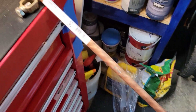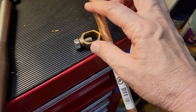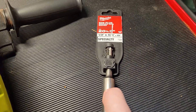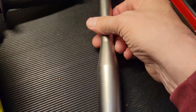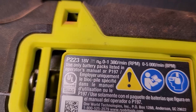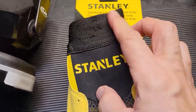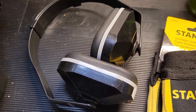For this project we're going to be using an eight-foot long, five-eighths of an inch thick ground rod, UL approved. We're also going to be using a five-eighths inch grounding clamp that will attach to the rod and hold our cable. We're going to try to drive this in with a Milwaukee SDS Plus ground rod driver — it's five-eighths of an inch and about ten inches long. The drill driver itself is a Ryobi model P223, set on hammer mode. We're also using synthetic leather gloves — Stanley S77611 — and I'd recommend some hearing protection.